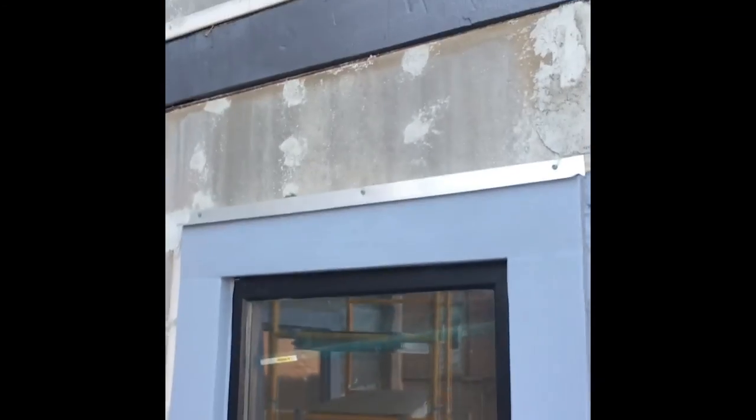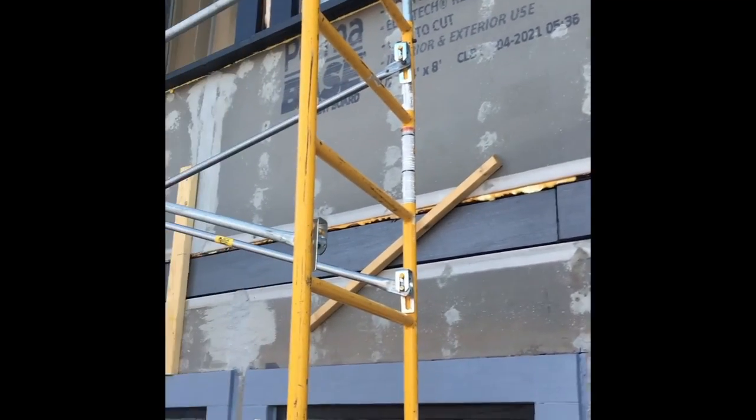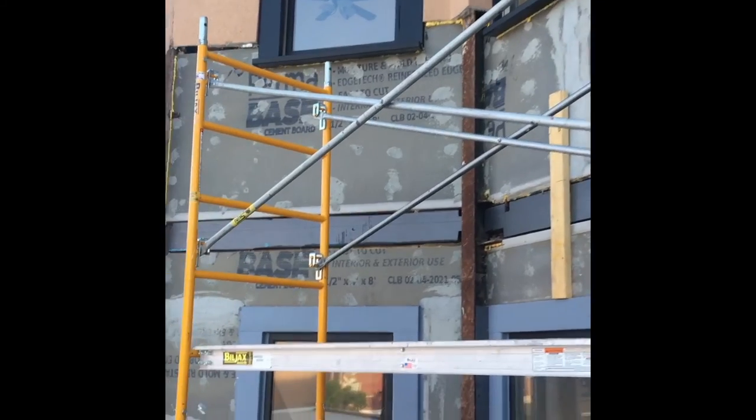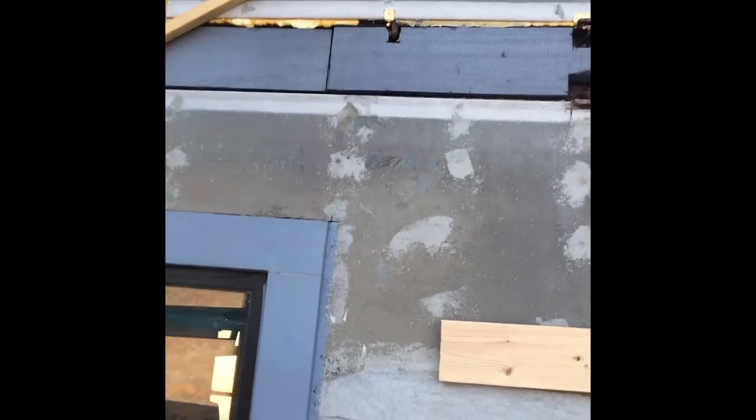That's the south window well on the Kenwood building. Crews moved over to this side to start getting that wire mesh up for the parging. You can see they've got that rigid foam backer in there covering the old steel beams. You see how they've kind of notched it around that joint so we can get a nice tight fit. Got a couple braces up here to hold it in place while that glue is setting, so that's glued onto that steel I-beam.